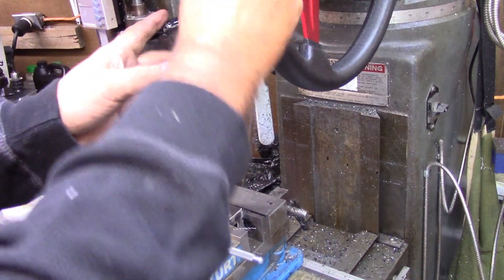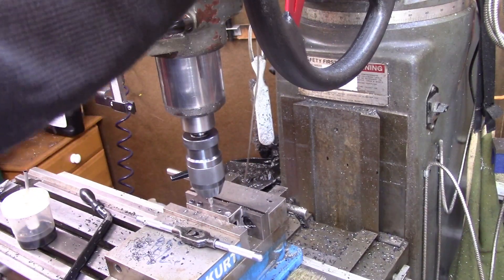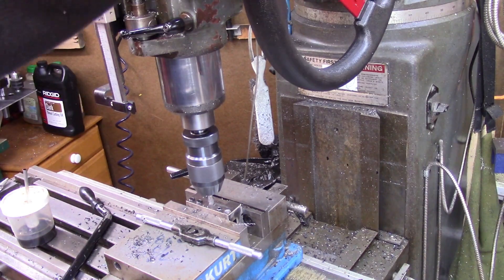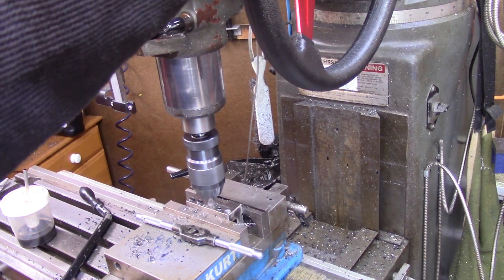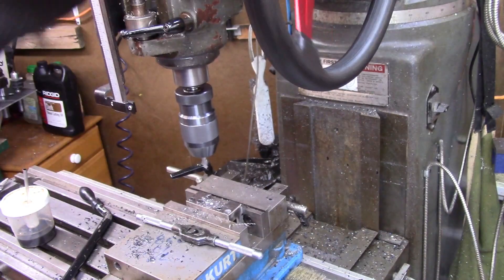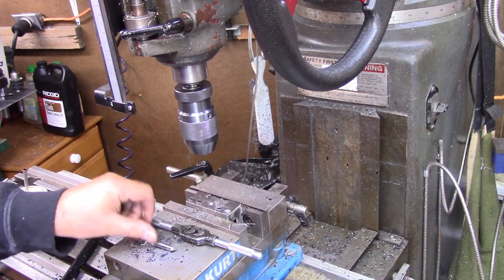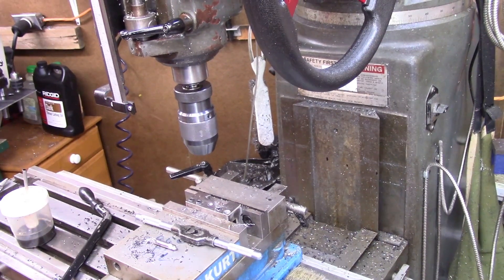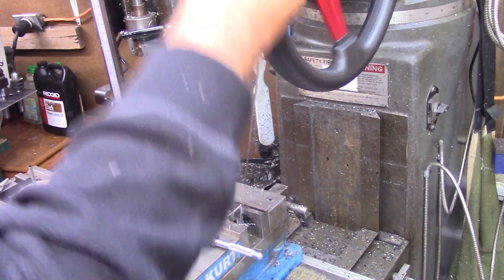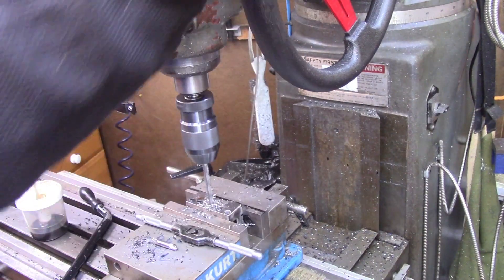The next problem I have is the original set screw here — the original screw that was in this thing did not work. It basically gave me a fail. So we're going to have to do something with it. My strategy is to go ahead and drill this out and put a 3/8 screw in it, or a 7/16 depending on how big a mess I made. So I center drilled it and tried to center it up by eyeball. What we're doing is taking a 3/8 drill, going down in here, and we're just going to put a 3/8 adjuster in it — similar to what we ended up doing with the other one. We'll re-thread everything and adjust it to 3/8, which is not a big deal.